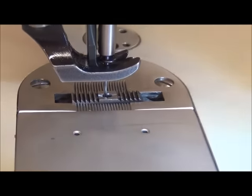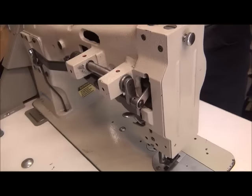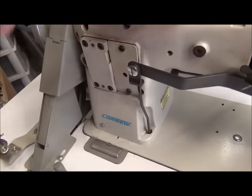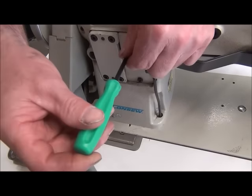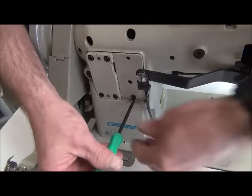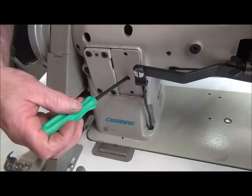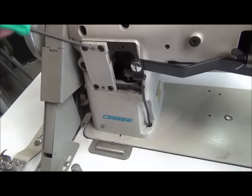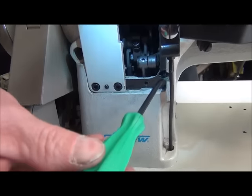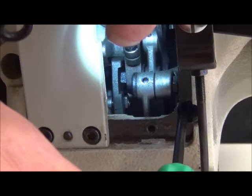The way we make this adjustment is a little weird and the screw is in a really weird place. We have to come to the rear of the sewing machine and take off this little cover right here with these two screws. These things should not be gorilla-gripped — just on and snugged. We take this little plate off, and down inside here there's a hole right here. Stick your screwdriver straight in, directly back there, and there's a screw. Loosen that screw.